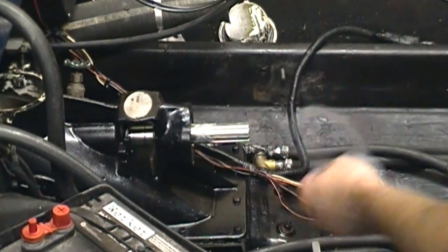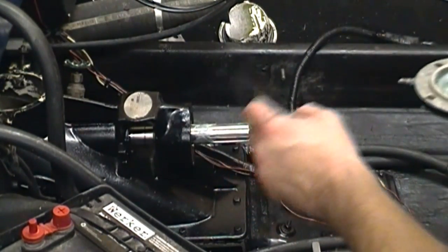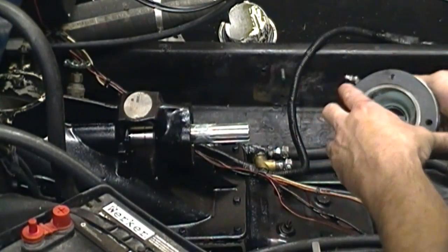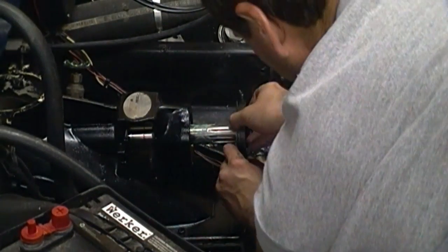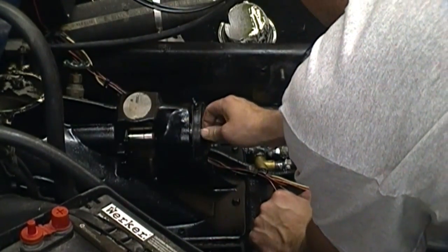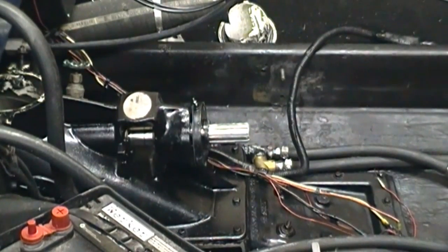You can see I've packed the inside of the lip with grease. I'm going to install the gasket. I'm not going to bother putting any sealant on it, because the grease can just flow right out the back of this thing. And the bearing cap cover — I'm going to put the greaser towards the top. The manual says to install Loctite on the four bolts that hold that in there, but it's aluminum threads, so I'm going to go with anti-seize.